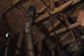I'm going to check all the vents to make sure that nothing's been displaced. Sometimes a vent from an AC unit or from a bathroom will become displaced from somebody putting in insulation, so I'll do a quick visual to make sure nothing's been displaced.